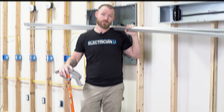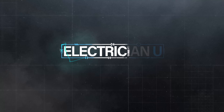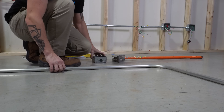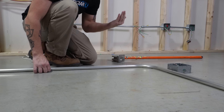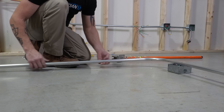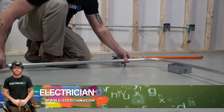How do we bend a kick in conduit? The reason we would use a kick is say we have an extra obstacle — we need to make a 90 and change elevation. To get over this, we wouldn't be able to put straps all on the bottom side and do this. Our pipe would look crooked as hell.